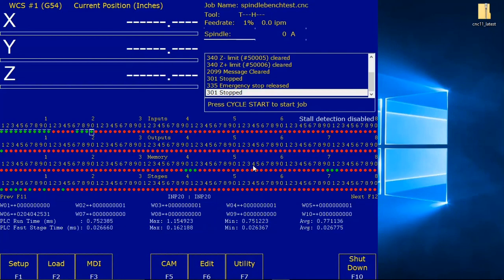You will notice that the LEDs will turn from red to green and a line will be drawn over the top to indicate that the state of the input has been programmatically inverted. So that's what we've done. Note, using Control, Alt, and I simultaneously to disable I/O only works for those using the latest version of the default Centroid provided PLC program, which I'm working with.